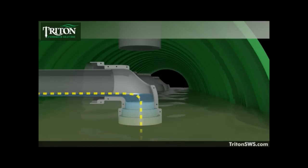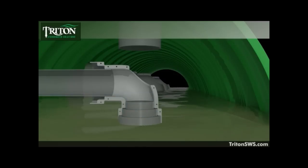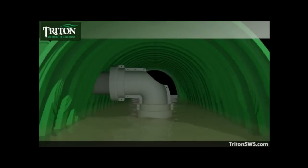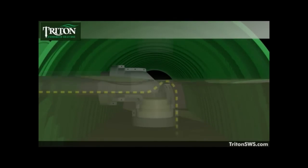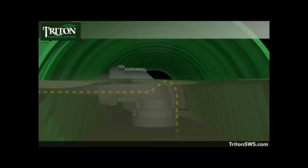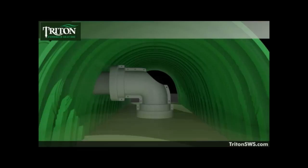The result is that cleaner water is stored, leaving fewer contaminants to leach out in the infiltration process. In the case of a first flush that threatens to flood the site, water bypasses the filter elbow and puck and is distributed directly to the storage chambers to protect the development and prevent water from running off the site and entering civic stormwater sewers.